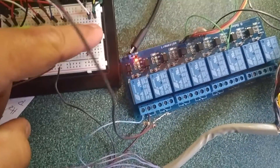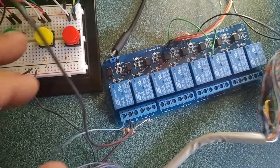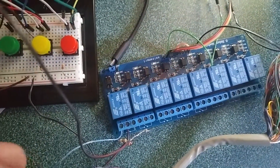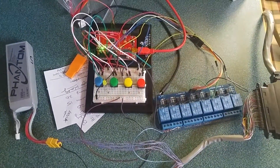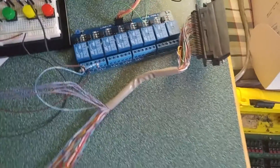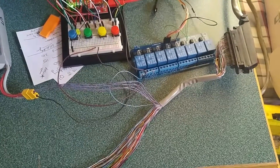What you can see here is when you push the buttons, it'll run. I just have four channels hooked up right now. You can see the lights coming on, and that's what runs it. Basically it's just powering a little relay board, and that relay board puts the full voltage of the LiPo battery across the e-match.